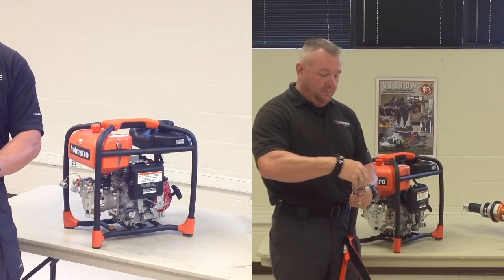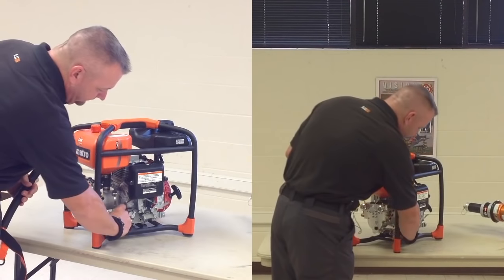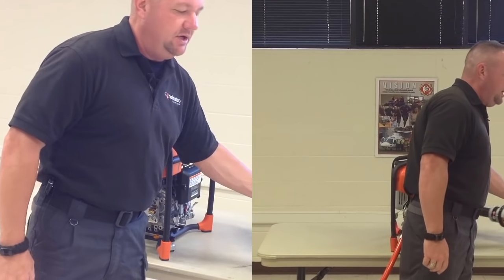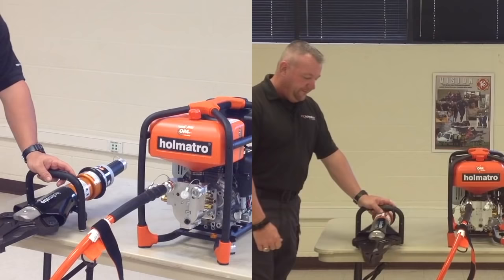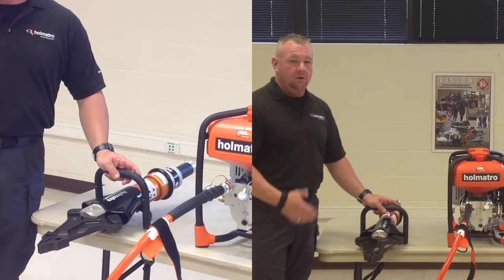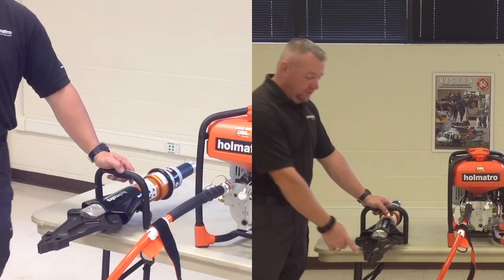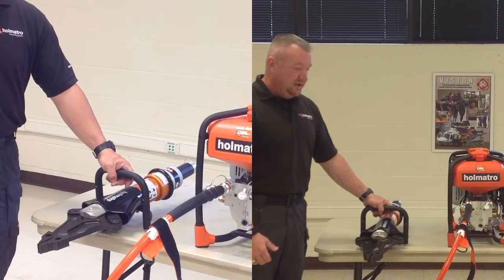The PRD is very infrequently used, but it can also aid with a tool that might have been left out in the sun or closed completely, where pressure built inside and it was stored that way. Once the pump is plugged in, the hose is ready for use and ready to plug into the tool. The tool itself is a combination cutter-spreader. It has a 14-inch spread and a 9-inch cutter opening. Be aware that the cutter opening doesn't go all the way to the end of the tool — the top two inches is a spreading or squeezing surface, so when you're cutting material with the combi tool, you have to keep it in the cutter blade portion if you want to complete cuts. The tool develops about 7,500 pounds of spread force at the tips, making it a very adequate spreader for removing hinges, opening hoods, opening doors, making entry into buildings, or vehicle extrication work.